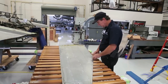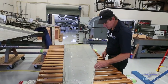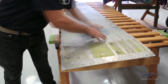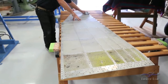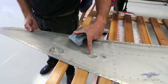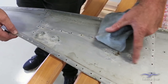I'll put some damaged area here and straighten this out so it doesn't throw my pattern off the new skin as I drill it up. I'll wipe it clean and set it up on the new skin and start drilling. I'm wiping off the extra burrs, dust, dirt, and debris from the years this airplane's been together. I'm looking for damage, looking for anything that might indicate a repair in the skin so I can eliminate that as I make the new part. Notice here there's corrosion — that shows a good example of why we take some of these apart so we can evaluate what's inside. We can't see it when it's together.